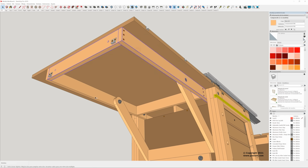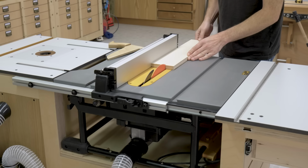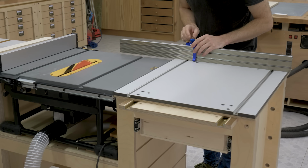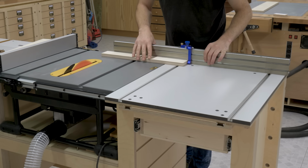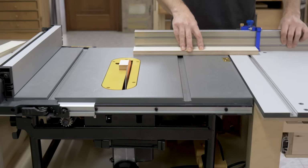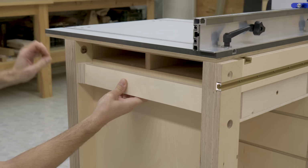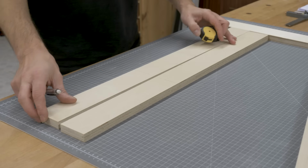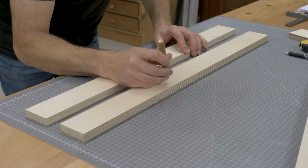Now I'll show you how to make this folding table. I'll start by cutting all the necessary parts to build the lower frame of the table. I make sure the two shorter pieces of the frame are the right length by checking whether they fit in the side gap of the workbench. Now I mark and drill all the necessary holes for the screws with a column drill.